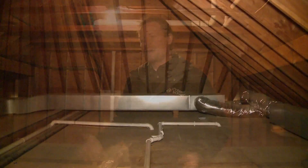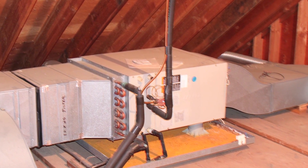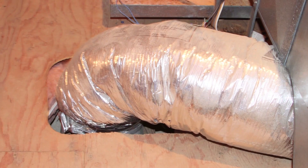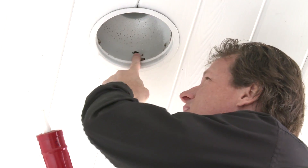Why is it warmer in the attic? Well, we have heat escaping from the house, from the ducts. Here we have air handlers that are hydrocoils that have hot water piped to them. We have conductive heat losses from the gaps in the insulation, and through can lights and so forth, that are heating this attic — and that heat is then lost.